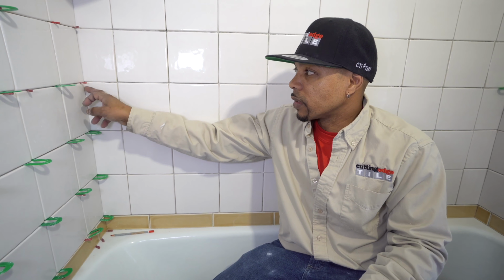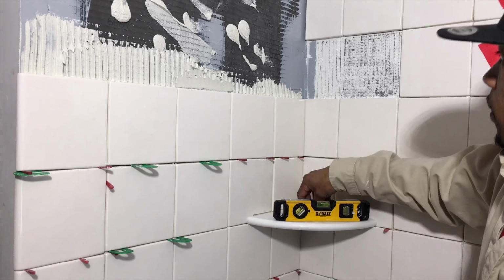While we're grouting the walls, we're going to leave out the corners, and any place that we're supposed to put silicone, we're going to leave it out. We're going to leave that area nice and clean. Okay, and then after the tile is grouted, we'll polish the walls real nice and clean, and then the final step is to put our silicone in the corners, and then we should be done as far as our part of the job. After we get done, the plumber will come in, he'll put his plumbing fixtures on, and everything else in the bathroom will be complete. But as far as our job, what we have to do as far as tile is concerned, we should be done today.